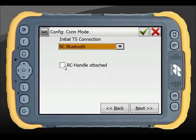You can also have the RC handle attached — the black handle with a button for your sliding mini prism — and press that button to record points. This is very handy for concrete set-out and similar tasks.